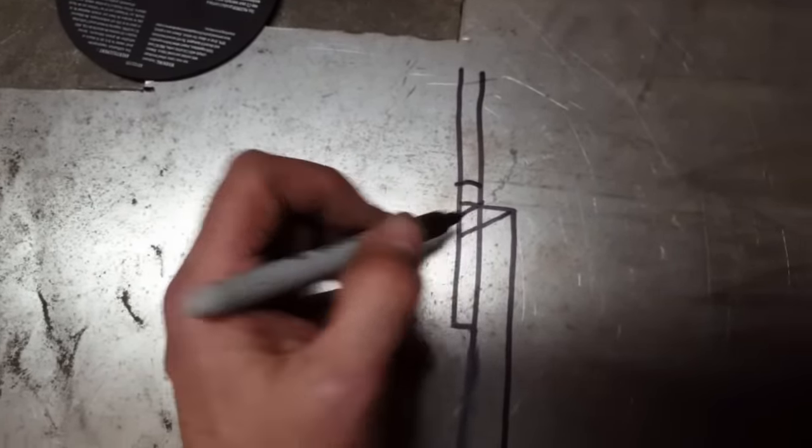And now that you got this all cut, you're left with a piece inside. So you've got to come in here then. I got it all broke clear here. Just got to get it out there. Anyway, got that with a grinder now and get that out there, because of this door. There we go. There's that piece. That's the quarter panel. So that's removed, and you're left inside with the butt weld panel as it is.